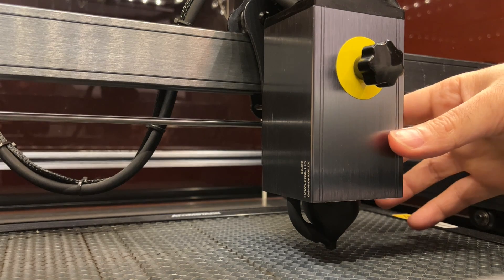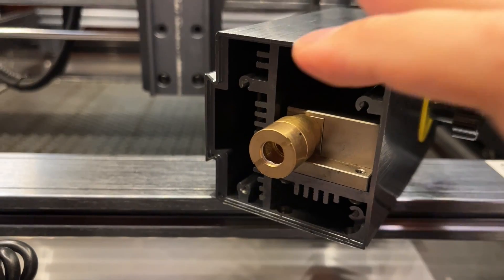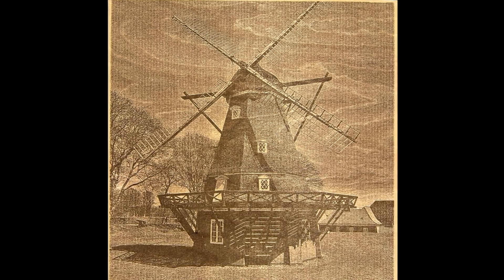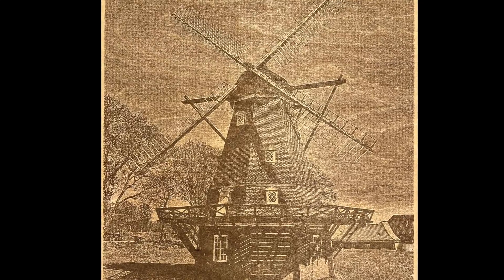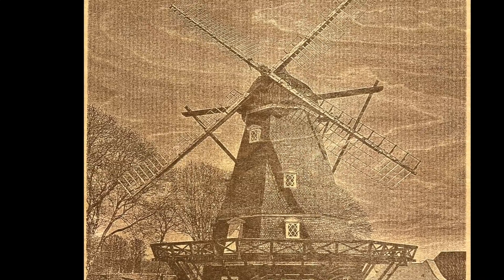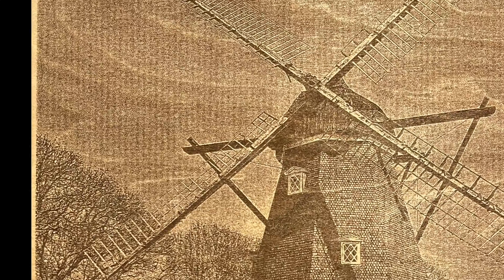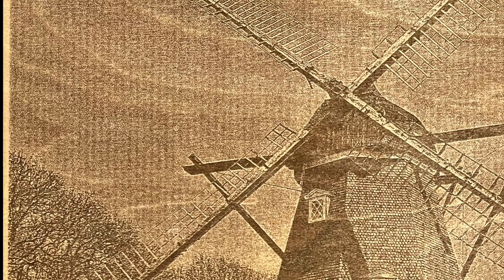Check also that your laser head is fixed solid to the gantry, and also the protective glass on your laser head, in case applicable, is fixed in position. If you are still experiencing periodic lines parallel and/or perpendicular to the scan lines, here I have found two solutions which at least worked on my machine. Hopefully this video may help you as well to remove the periodic horizontal and vertical artifacts and improve your photo engravings.